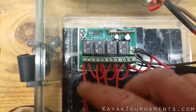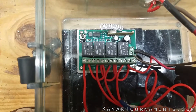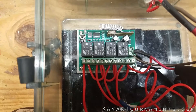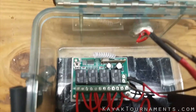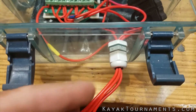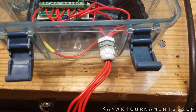I have a power wire ran from each of the A's, and these are running outside of the box — those are gonna go to each set of lights that I want to control with the switch. I used another cable gland on the front for each of those four wires to run out of the box and to your LEDs.